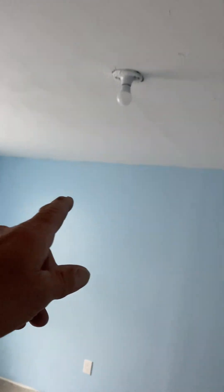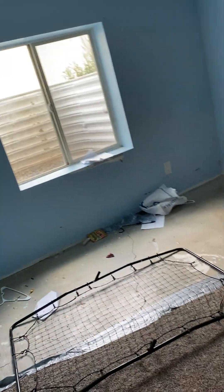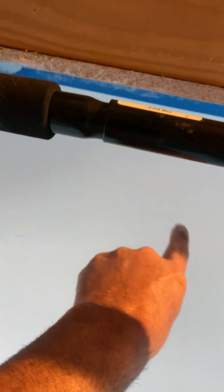Try to knock the header out and cut a hole like normal, then run your pipe down. Hopefully slide it down without cutting any sheetrock and cut a 4x10 here. For the return air, this scope doesn't have a return air in here but I'm sure he meant to put one — it has to have one. We're just going to put a 4x12 ducted up and tap into the bottom of the return air right above the door.